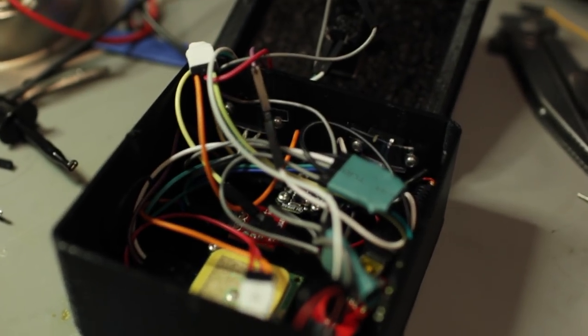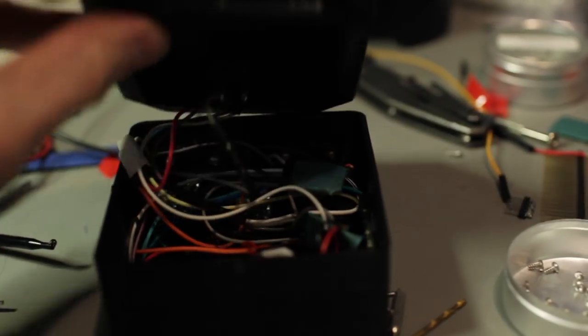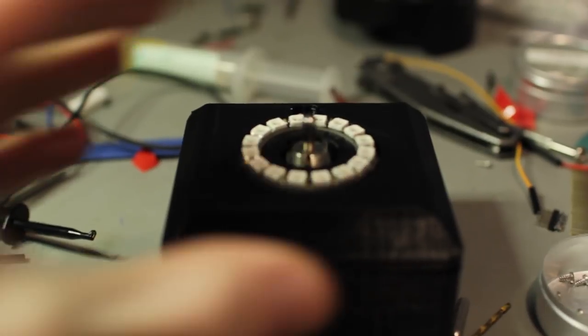This project is pushing the bounds of the GPIO on the trinket. The GPS needs RX and TX to send commands but it's already configured, so instead I'm using the trinket's TX as an IO for button input. I also ran out of button pins because I forgot about the NeoPixel, so one button is now a reset. To work around that, if you hold the other button and press reset, that'll bring up a new set of commands like selecting your next location.